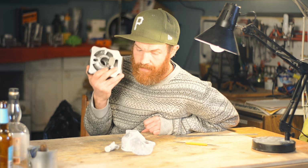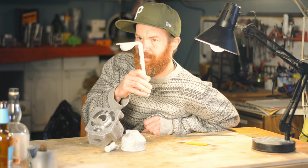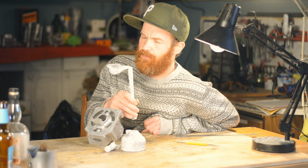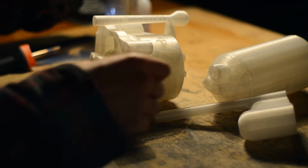I think if I fix a couple of issues, you saw one of them, the pouring basin was far too shallow. That's because I didn't have enough plaster and I thought it would be okay. It didn't. It poured over into the riser.